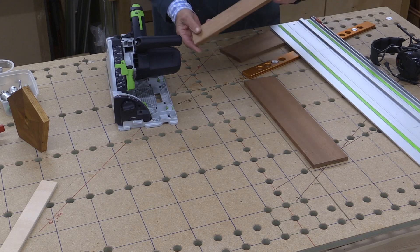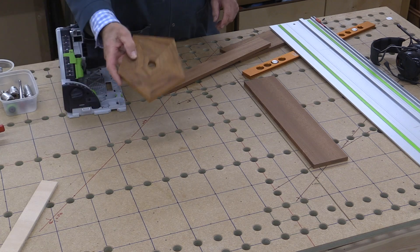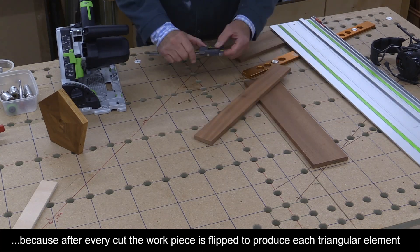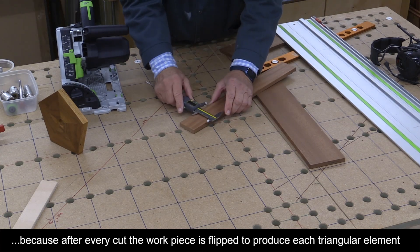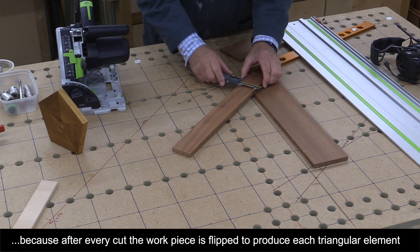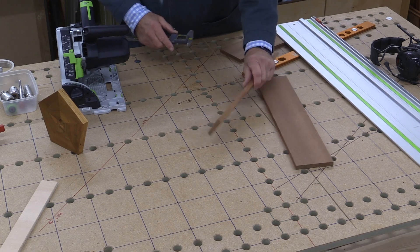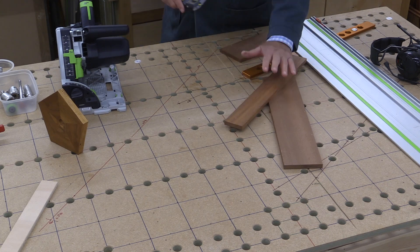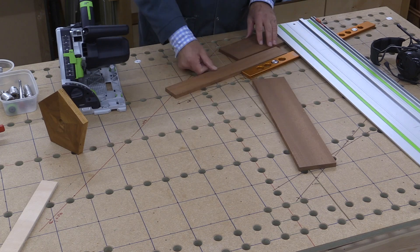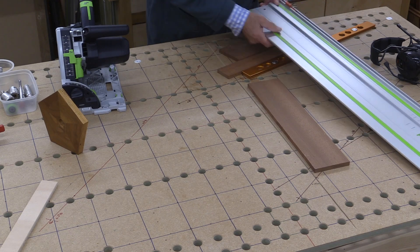My stock that I'm going to be cutting is this. And something I didn't check when I made the pentagon is that the stock has to be absolutely parallel. So this time I've checked this — it is 56.07mm at one end and 56.06mm at the other end. That's as accurate as I can get with my equipment. There's my stock to be cut, here's my supporting piece, and I'm going to set this up now and we'll see what happens.